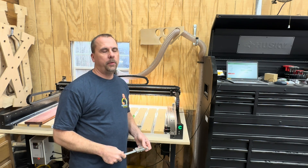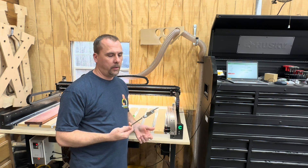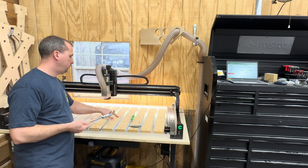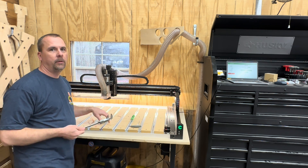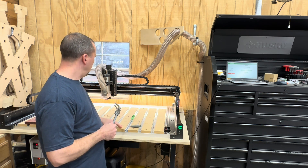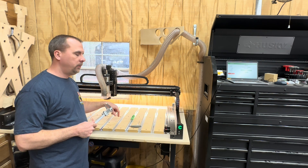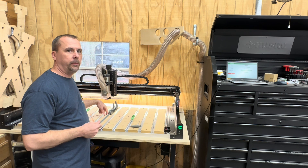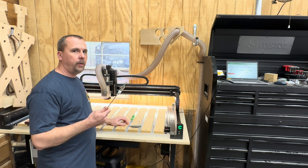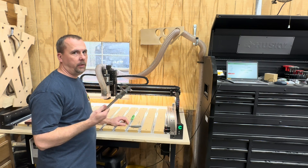One more thing I suggest if you buy any CNC machine: calipers. You almost can't run a CNC without a set of calipers because there's no way to accurately measure how thick your wood is. If you don't put the right thickness in, you get this problem — this is your spoilboard cut up like mine is, and that's because I put the thickness of the wood a little bit more than it actually was. That's something you have to really pay attention to on every new project. If you don't remember to change that in the setup, it's really going to screw you up.